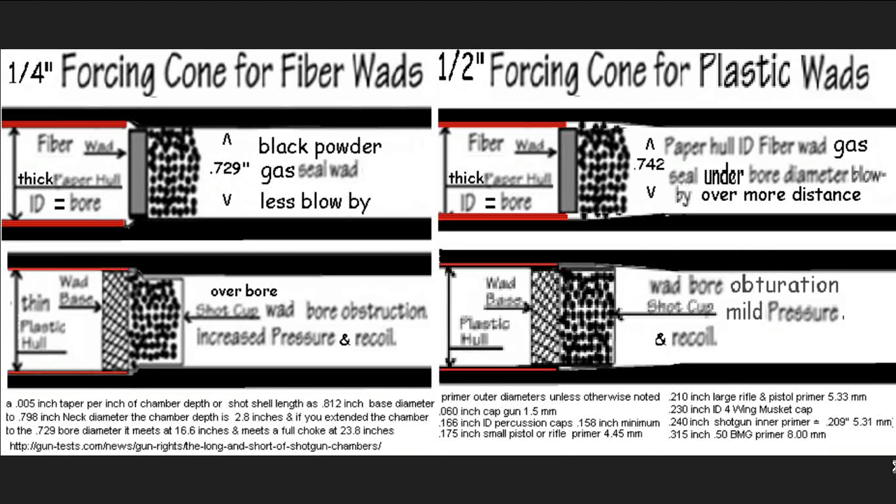You might wonder why there's a diameter change — wouldn't that make it more difficult? You start off with one bore diameter, then drill it out with a 13/16-inch drill, which is close to .81 inches. The chamber taper is then accomplished by reaming it, usually with a piece of tapered square metal bar stock. It's easier to make that and then harden it by heating in a fire, which mills or pushes the metal aside if it's soft steel. Then you can harden the barrel and you have a working gun barrel.